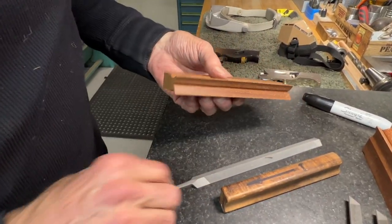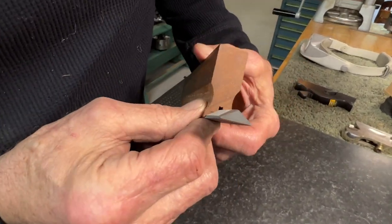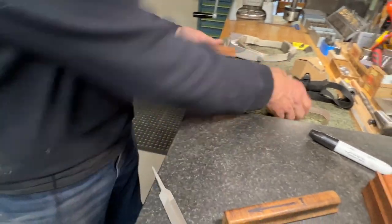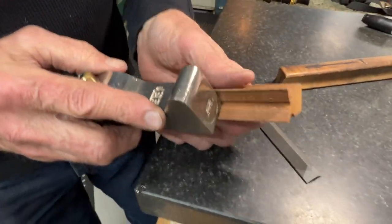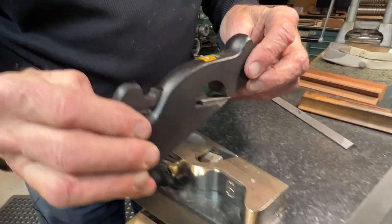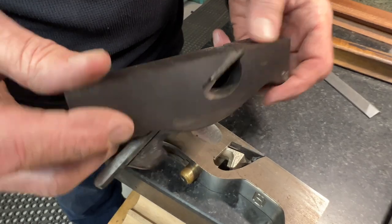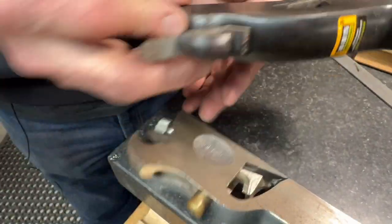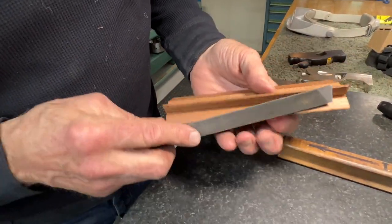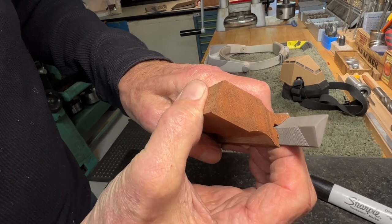To cut these surfaces to accept the file, we want to put some angled surfaces in here. You've seen I've cut with a table saw down the center to relieve that. One simple way to do this is just on your woodworking bench with a rabbet plane. Here's a nice old Stanley I've had forever, and here's one from Asia — ebony with a wedged blade, which actually works pretty well. Two different interpretations of the same tool. Either one will get these two surfaces planed — just cut and try to make sure you get it. It doesn't have to be perfect, but it's nice if it's good.